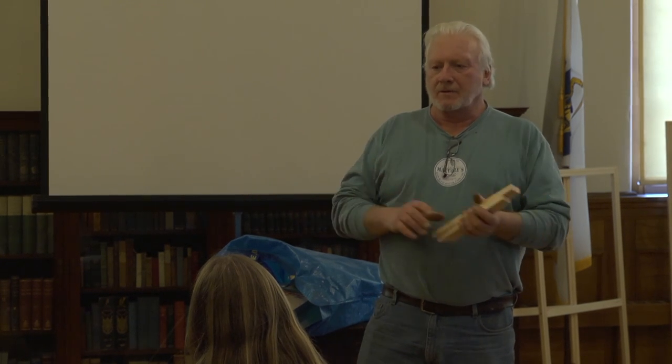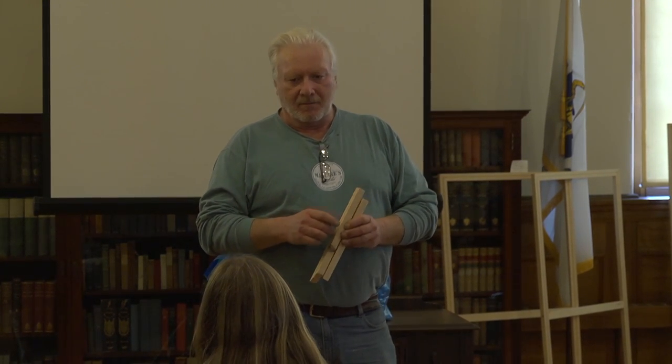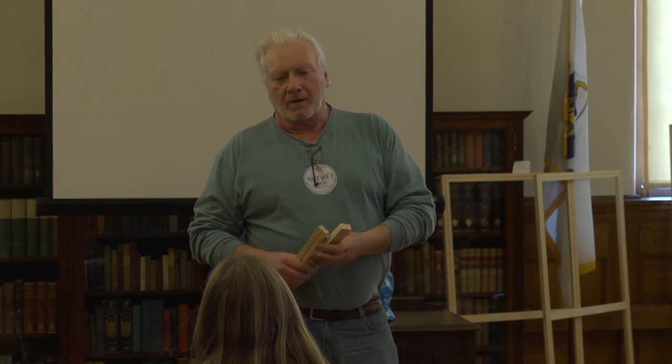You want to use this wood knowing that after you mill the material, there may be little twists and bends in the wood. So you want to make sure all the bends go outward on the frame, because you want it pressing out as much as possible. That's why you want this cut balanced on either side, looking at it from the end, with exactly the same measurement from both sides. Whichever way you cut the 45, you get a nice tight fit on the bead. That's getting the cleanest stock you can, based on your wallet.